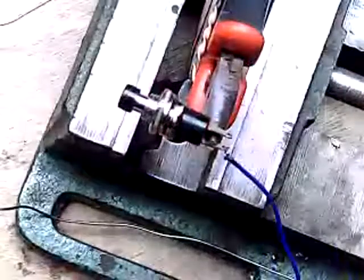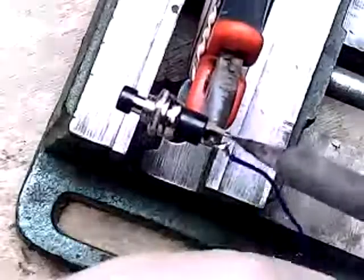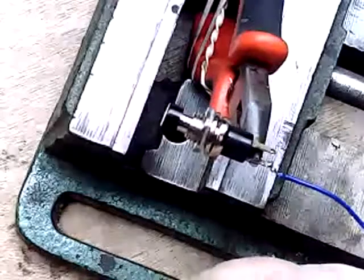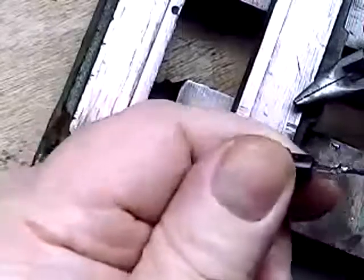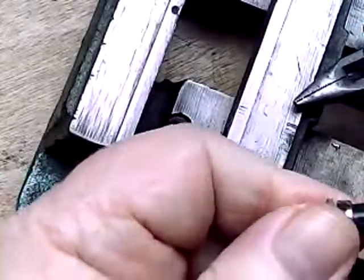And there you see it. Now I bring this up and I bring the solder up. See the bare touch. And I want to straighten the wire out, long ways. Okay, take that out. And a little tail there. I don't want a problem with that. Trim it down. There we go. And bring down a piece of heat shrink. There it is.